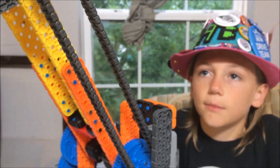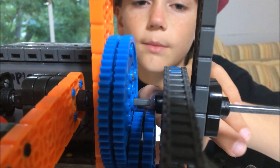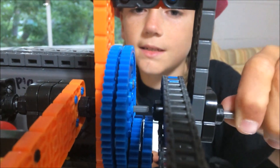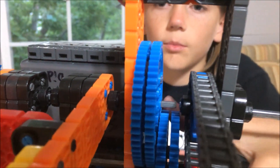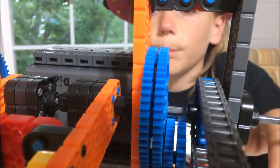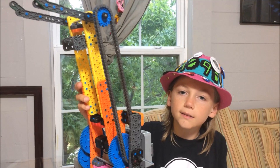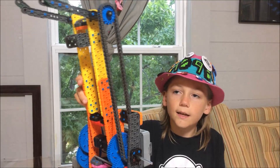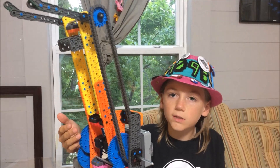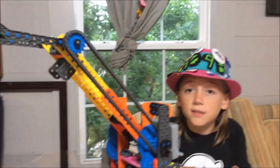The chain stays the same length on each side. It has to be two separate shafts — one needs to stay stationary, while this one needs to be able to move to control the arm. And basically, it takes the problem of the space that the 4-bar takes up and reduces that down to a minimal size — the size of a 2-bar. And it works just the same.